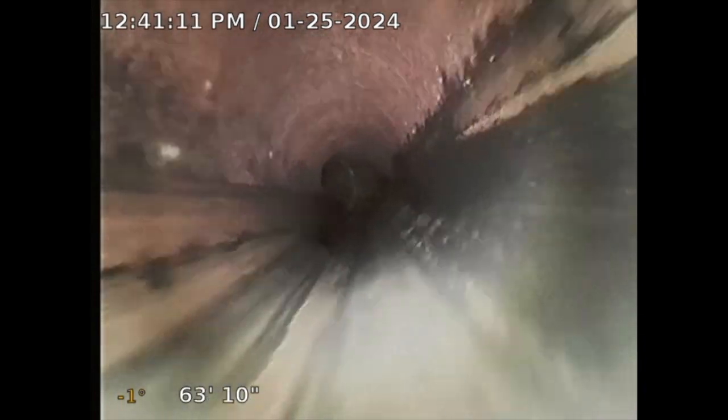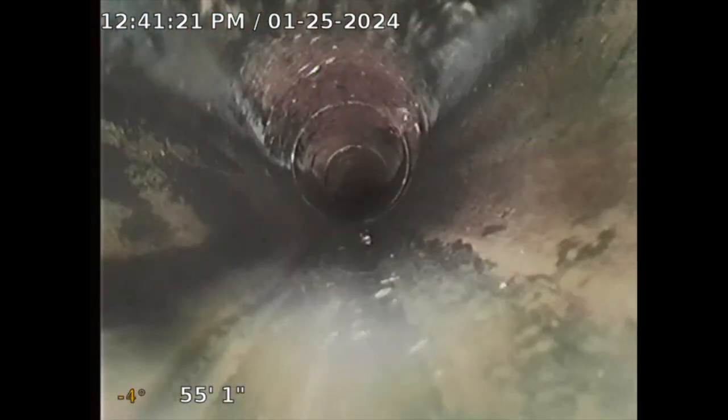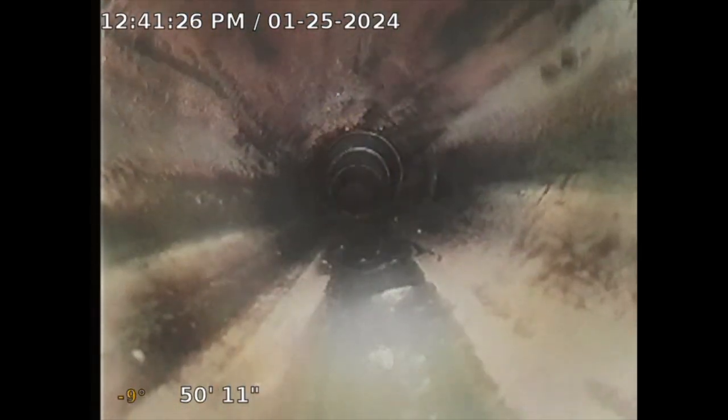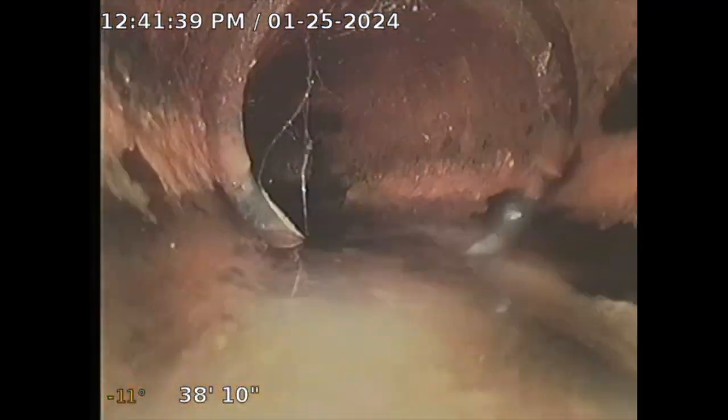There's all kinds of mulch and I didn't see a clean out. If there isn't one, you might want to put one in. I'm not going to tear up your lawn or mulch to look for it, so hopefully there's one installed — if not, that would be recommended. I'm 46 feet out — it's a long sewer line. I've seen all this and it looks good. A few areas of standing water, but that shouldn't be a big issue. The slope of the sewer pipe looks good.